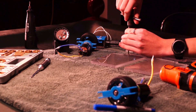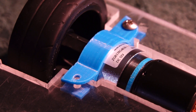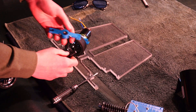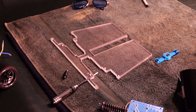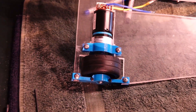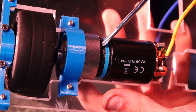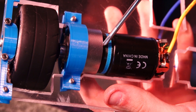The first gearbox motors we selected became almost useless. A breakthrough occurred when we decided to go beyond our expertise and craft our own motor system. We bought new gearboxes with a 1-to-40 ratio, setting aside the useless motors. Combining that gearbox with 30,000 RPM motors from past HockeyBot iterations, we knew we would be spinning at exactly the RPM we needed, hopefully with enough torque to move the robot and its load. A 3D printed adapter plate and a specially milled pinion gear successfully secured the two components together, and our motor system was born.